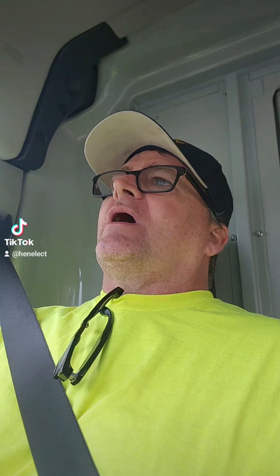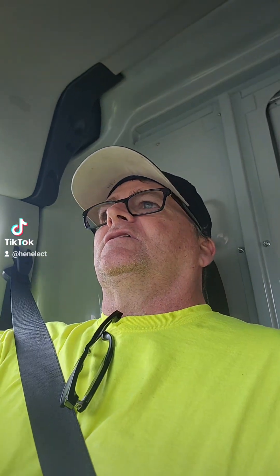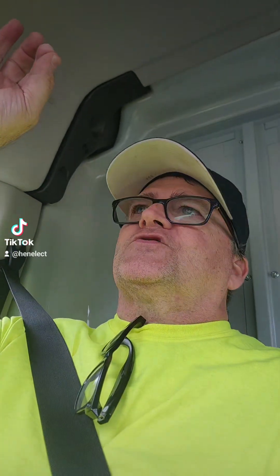So my fault in a way. I see that the load side of the switch is completely out of the spring back — it's just laying in the box. I'm like, oh great, that's an easy fix. So as I'm pulling out the switch, I got my ground connected, and I noticed the line side — the whole switch is broken. The whole back of the plastic is broken and the wire is literally not inside the switch. Must have disintegrated, I don't know.